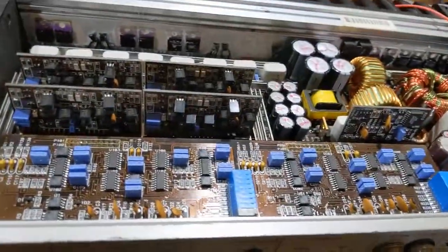Here's how these things come apart. First, underneath on the front side are all of the speaker and power terminal screws — you've got to screw all of them in first, otherwise it won't clear the plastic. Once you do that, there are nuts and insulators that have to come off on all of the RCA connections. Then there are hex Allen M2.5 side screws. Then the two plates come off. You also need to take these clips off — there's a hole in the top and it's very easy with a right-angle hex key. You put it in the hole, rock it back, and it pops right off.